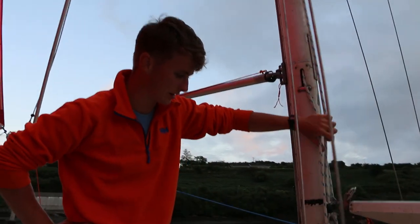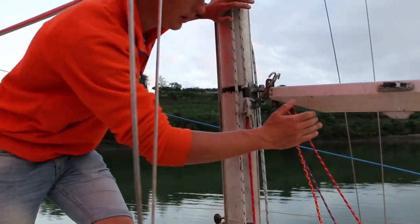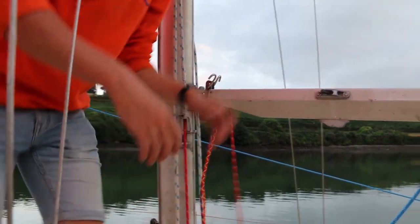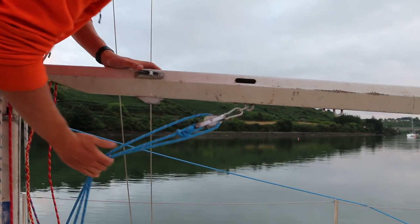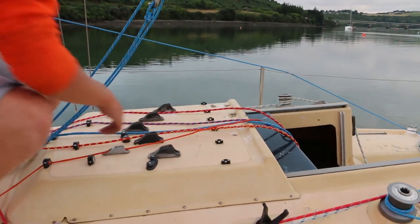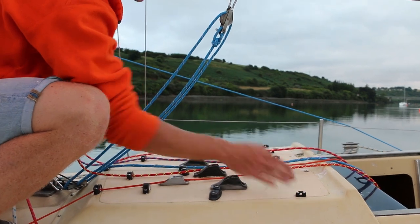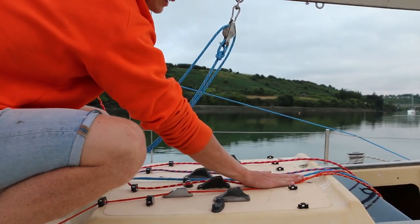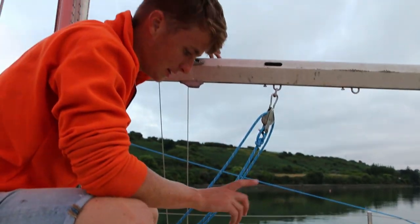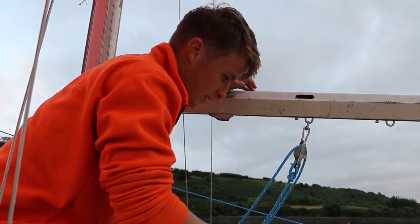Since we've last spoken I've replaced a lot of the lines on this. So this is a new main halyard — that's again 8mm Dyneema. I've got two reefing lines, an outhaul, a new kicking strap, a new kicker system, and it's all fed back to the cockpit here. The reason for these loops is you run either a bungee cord or rope through them, and over time it'll keep all these lines pressed down against the deck and help these racing cleats, which I'm finding really awkward to use at the moment. It should help them work, so I'll put a bit of line through that.